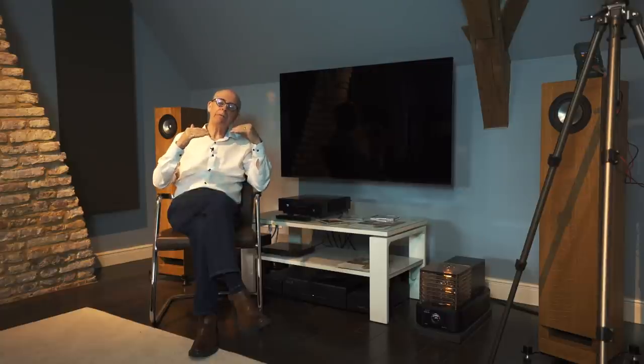At the highest point, when it was at its loudest, we see brief moments where it goes to about 7 volts, 7.17 volts, which means we're actually using 6.8 watts per channel at that point. So nowhere do we get above 7 watts, even at the very loudest peak.